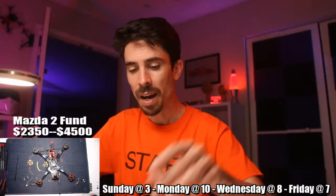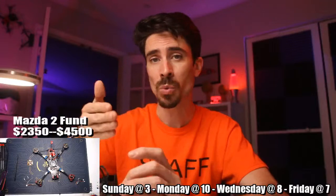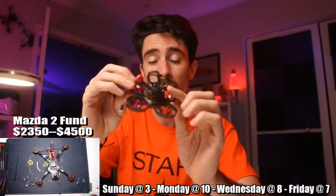No battery, it is at, yeah, see, this is heavy as hell. 24.6 grams, it might even be a little bit more. No, yeah, 24.6 grams, that's pretty heavy. 24.7. SR71, he was always shooting for 20 grams, as was I. I used to always shoot for like 20 grams, 21 grams, for a Tiny Whoop. What's nice is we've now got motors that make enough power to move something that's this heavy around.